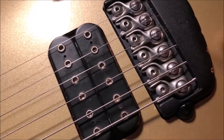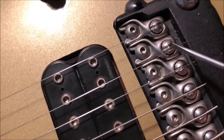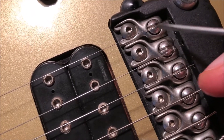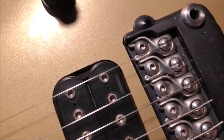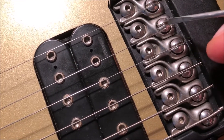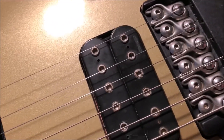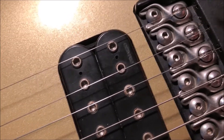I've removed this and cleaned off as much super glue as I could. With the cap not glued on and just sitting here, if I do a tap test — it's conducting. So that tells me that if I can just get this bonded to the crystal underneath with the right material, it should work.